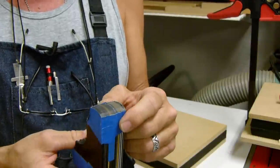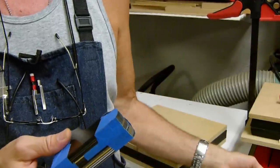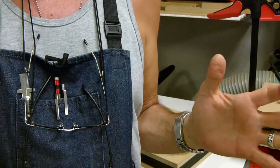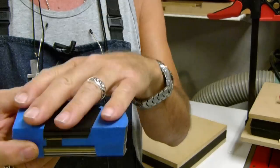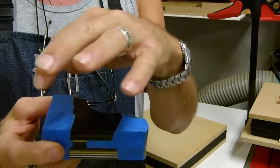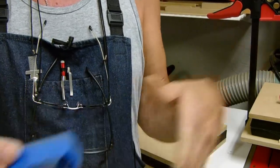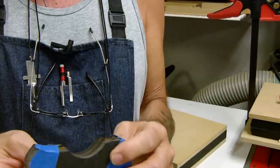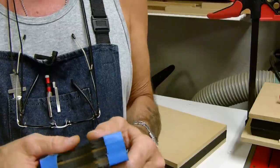And I plan on doing a video on cutting Kydex, how to use a table saw, what blade to use. I use a table saw to do the main blanks, and then I use a template on this, and I stack up 6 pieces of Kydex, and then the template, and then just run that through the bandsaw, and then off we go to the oven. So it's very good if you're getting into volume.